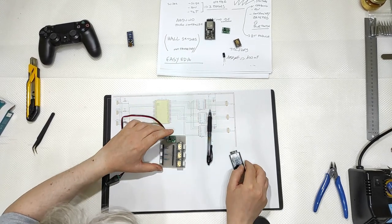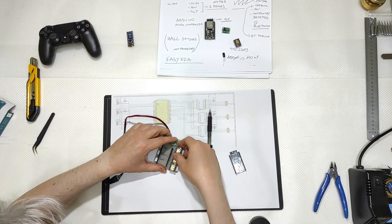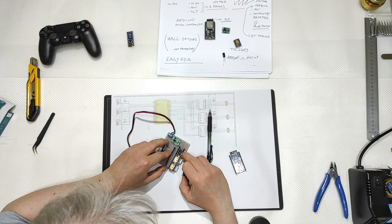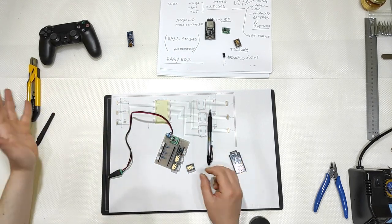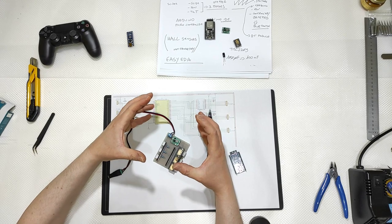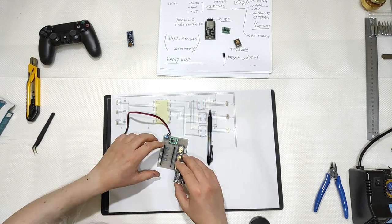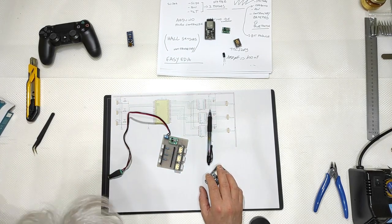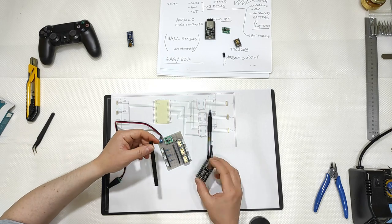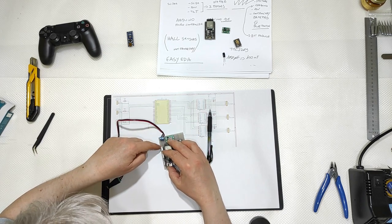So the ESP and the three resistors are there, and the capacitors are hidden under the stepper drivers, because otherwise this would have been much bigger, and I needed a solution to get inside the main pan circle where you have the cage. And those little connectors are very useful to not damage permanently the ESP32, especially, or any other components, especially because they are not the cheapest ones.